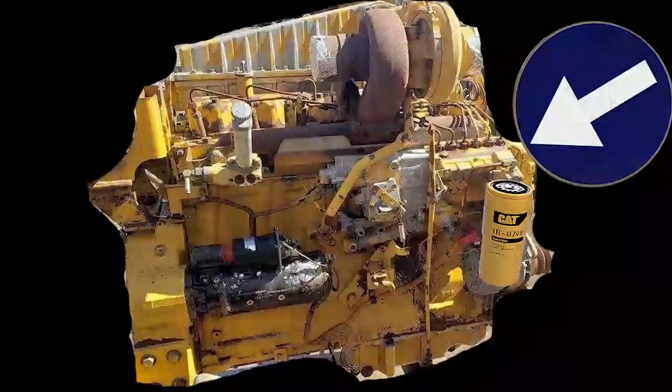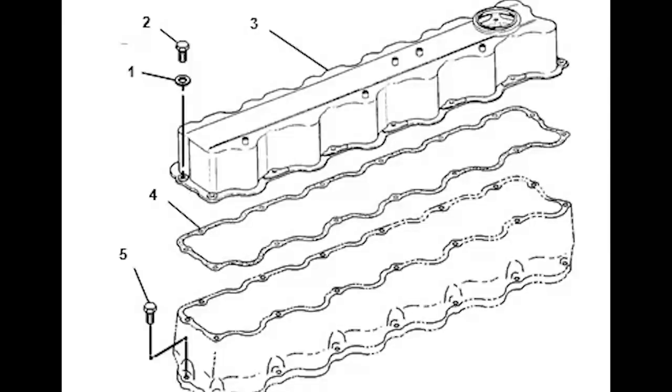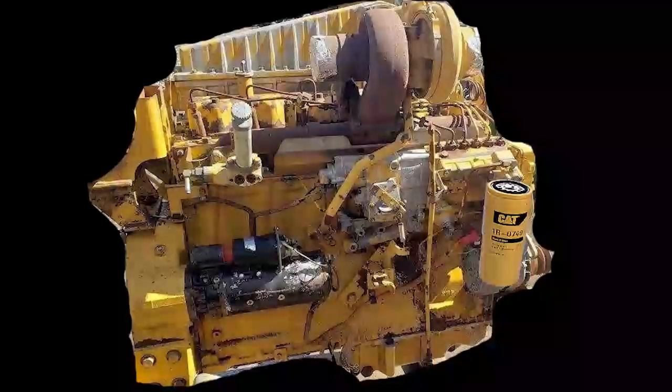The other main distinguishing feature is the valve cover. The valve cover on a 3306 is a single valve cover, whereas on a 3406, they have two different valve covers. These are all mechanical engines — there were no electronic 3306s. They just run hard fuel nozzles. On the 3306s, there's a big differentiation between what engine you have — whether it's PC or DI. You might see that: 3306 DI or PC. DI is what all diesel engines are now — direct injection — where the nozzle sprays fuel directly into the cylinder. On a pre-combustion chamber design, there's a little notch in the cylinder head that allows for combustion in that area first.